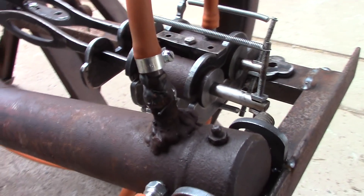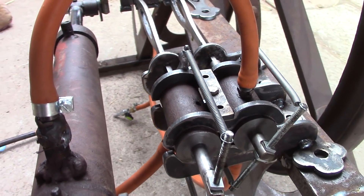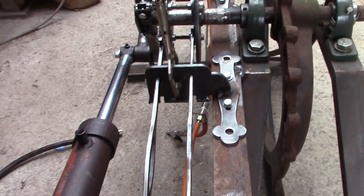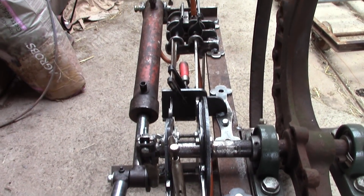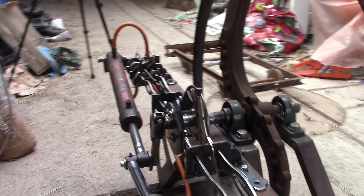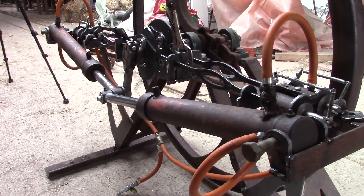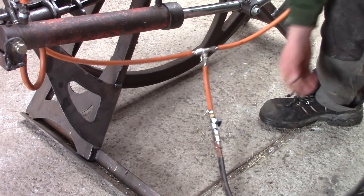That makes things really simple. I can adjust the opening of the valves by moving them forwards or backwards, and the cams and push rods handle the timing. Taking your advice, I shortened the length of time the inlet valves are open, which saves some air. I could do with better airflow from the compressor, but keeping things the same as last time means I can at least compare this version to the previous one.